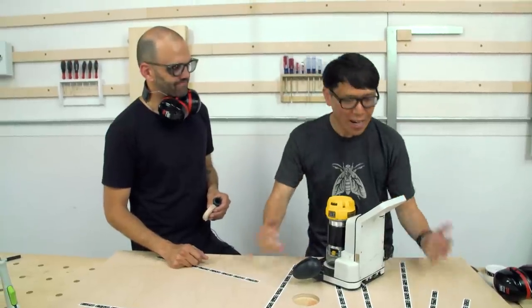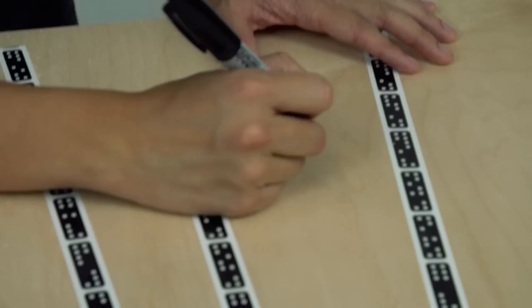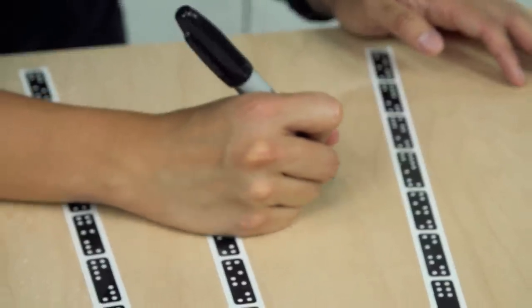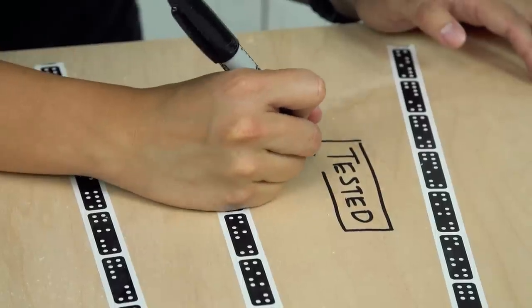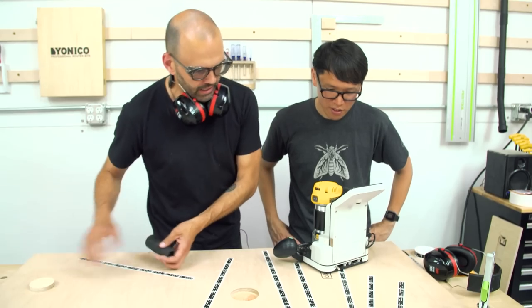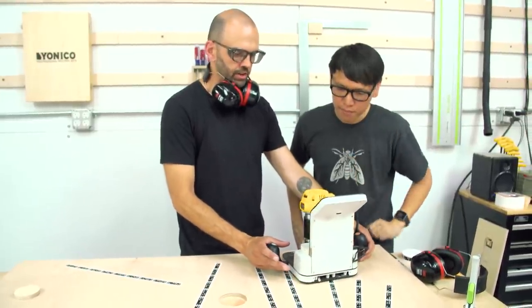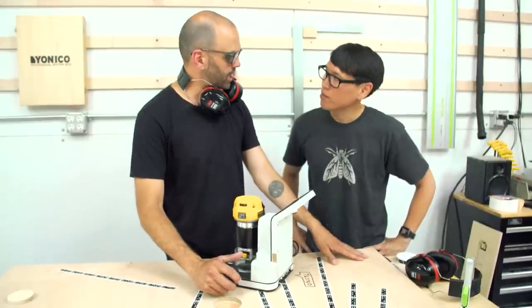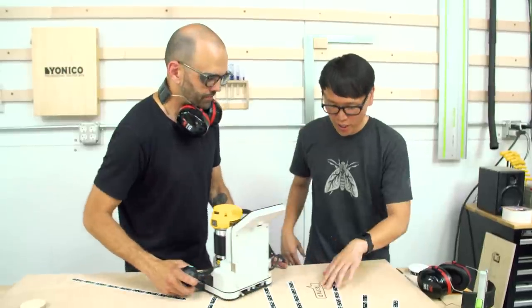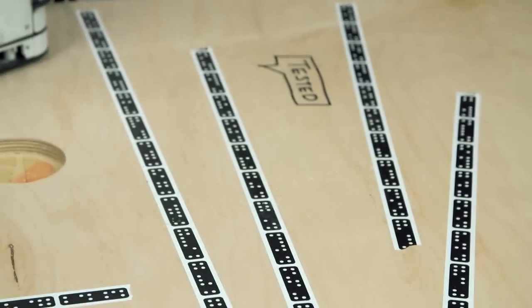So I have a polygon shape in mind. I haven't drawn it or given a guide on the material — the tool already did one scan. Can I add that in and just rescan? Yeah, just go ahead and draw it directly wherever you want. We'll write down the name of our website and then draw our logo around it right there — simple polygon shape. We can either orient the machine so you can see all these markers and cut it as is, or if you add some more tape here before the scan, you'll give yourself some added insurance. Not only can I add this drawing back into the map for the augmented reality portion, I can also add more tape and expand my material.